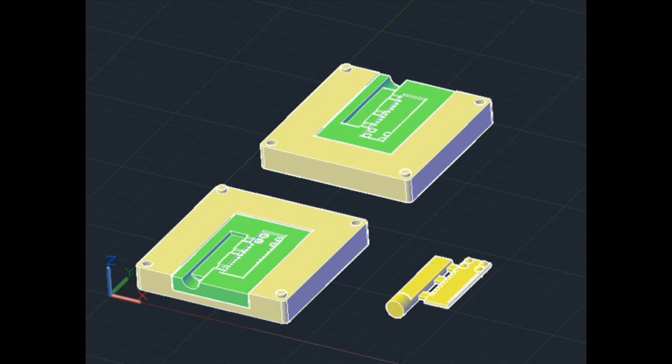The green material will be the tougher, more expensive, fine refined, prototyped product that will take the casting. The outer material will just be a 3D printed ABS shell that can be viced in for the injection mold to hold it in place. The idea is to keep the green as small as possible to allow the molds to cool and vent, but also not to deteriorate under pressure.